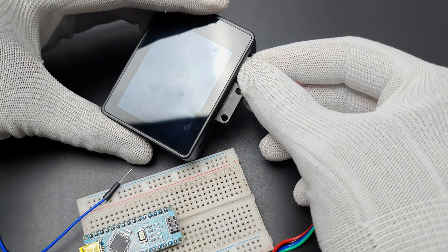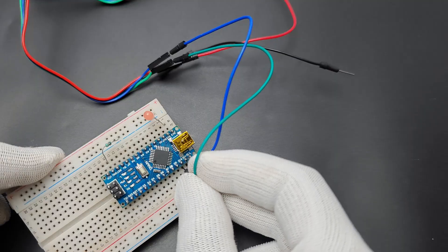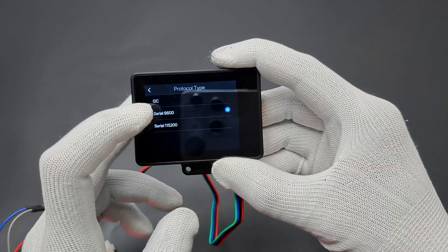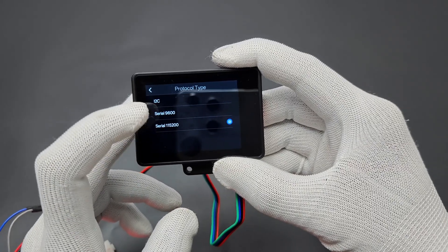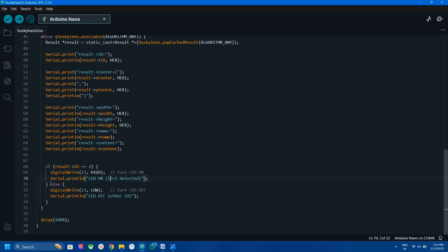To control the LED, we need an external controller. Here I am using the Arduino Nano. I connected the gravity connector to HuskyLens and the TX and RX pins to D10 and D11. In the HuskyLens settings, we need to select the protocol type as serial 9600. Go to the DF Robot site and download the HuskyLens 2 library and install it. Here is the code for gesture control to LED — I just modified the example code. The logic is simple: HuskyLens sends the detected ID via UART to Arduino, and Arduino reads that ID and controls the LED. When HuskyLens sees the open hand, it sends ID 1 to Arduino, and Arduino turns on the LED. You can see the working demo here.